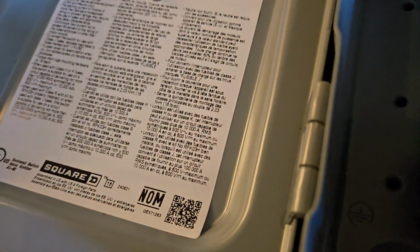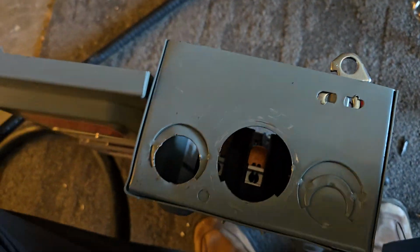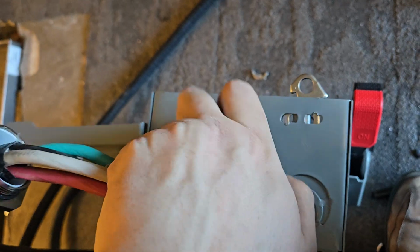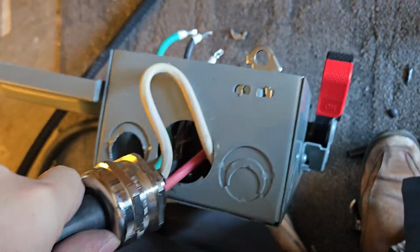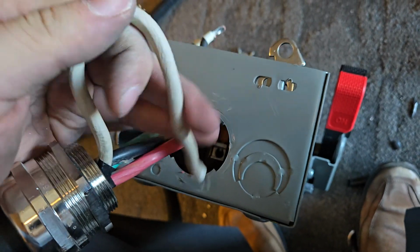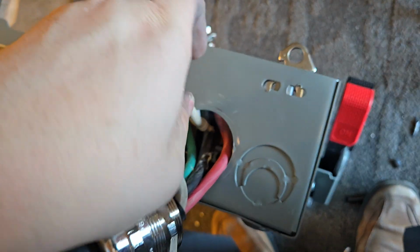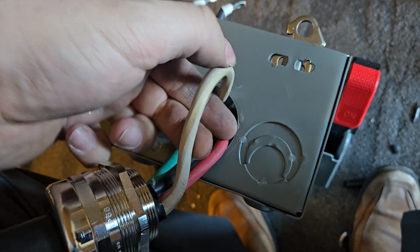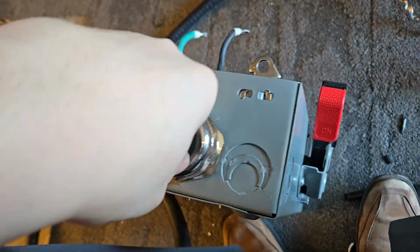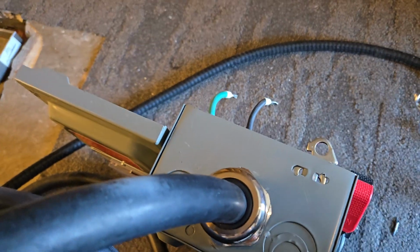So we've got to just make whatever hole we need to make. In this case, the escalator constructor made the hole, and then we're just going to shove our connector in. Now this is a European wire, so it's colored white, but it actually should be blue, because we don't have a neutral when we connect the motor. So this just fits in like that, and then we had a screw somewhere.